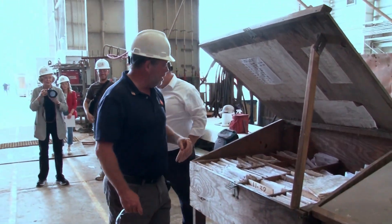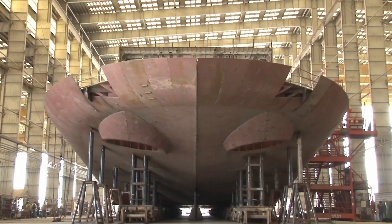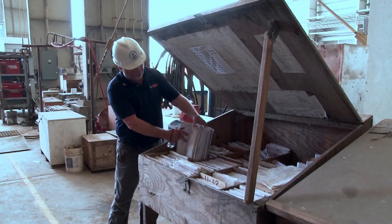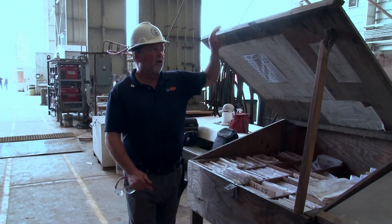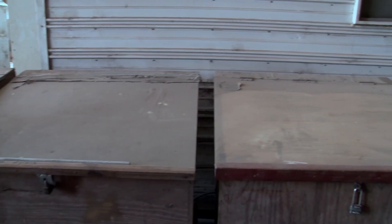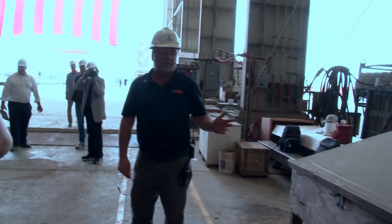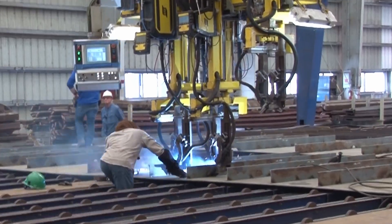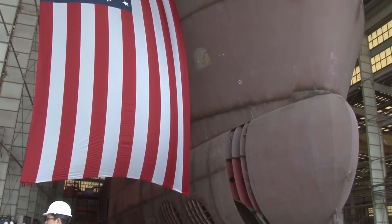These are drawings showing how each unit is built. Each unit — like unit 21 right here — has a set of drawings. So you have gray water and black water piping drawings just for the pipe department for this boat. You have similar drawings for electrical, for structure, for carpentry, for all the crafts on the boat. There's a tremendous amount of engineering done to make this happen. Everything is drawn out on paper, parts are ordered, and then the guys read the drawings and put the boat together as it's designed.